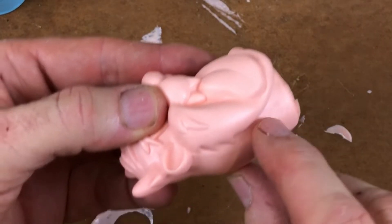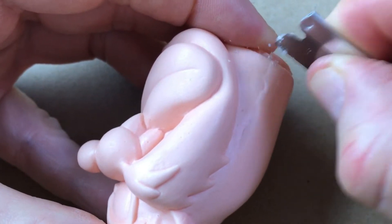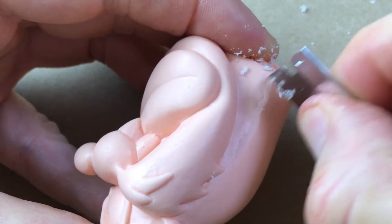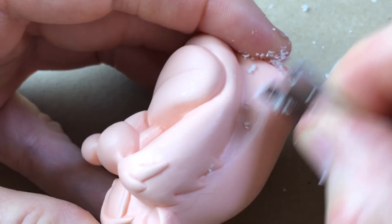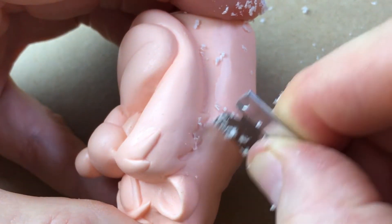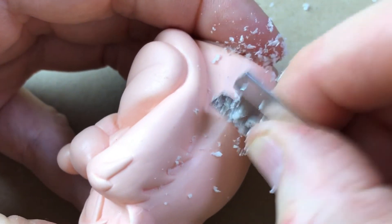There's still a little lip I can feel. I favor straight razor blades because I have the best control and can scrape really precisely — basically scraping down the high side to match the lower side of the parting line. Resin, especially when freshly cast, is very easy to work with — very malleable and easy to scrape. I generally try to fix parting lines as soon after casting as possible, because the resin is quite a bit harder after 24 hours than when freshly cast.